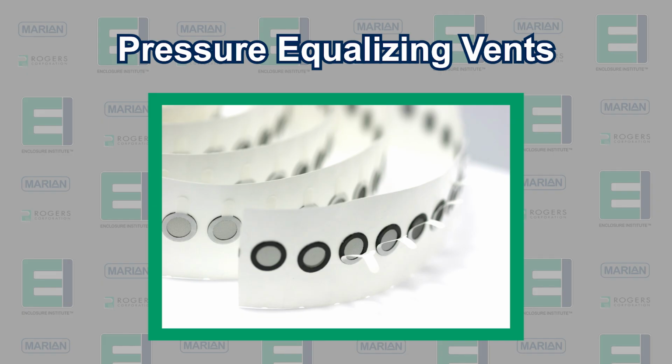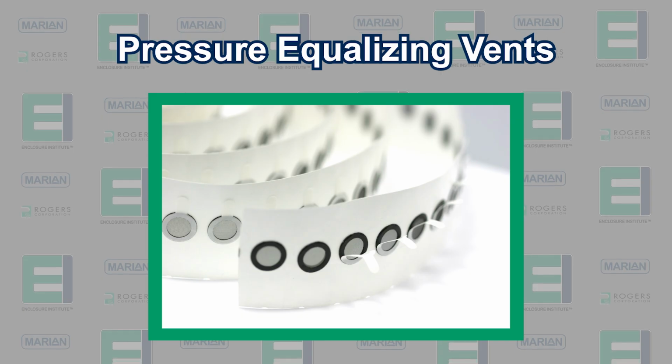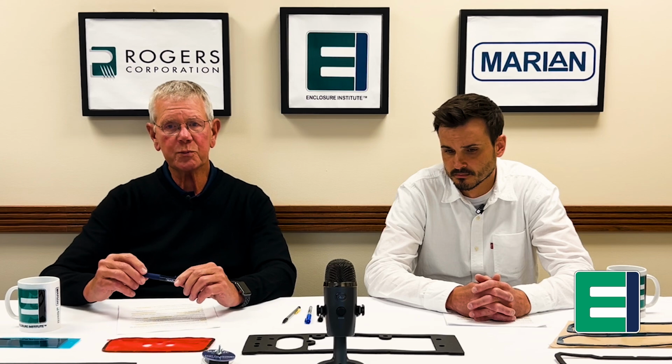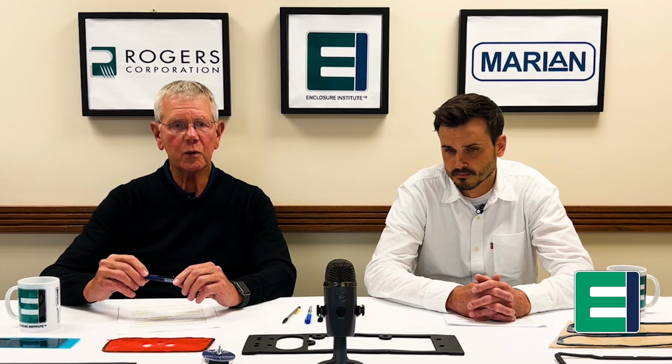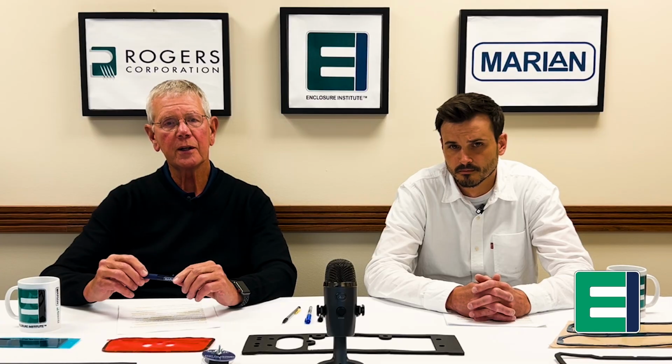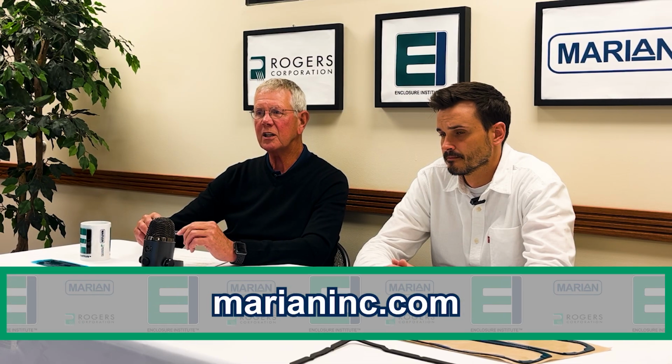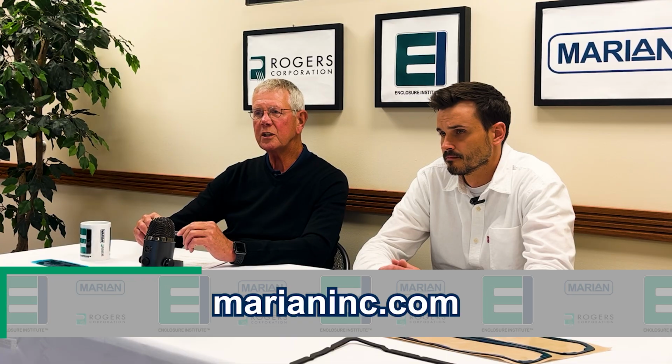You may need to include pressure equalizing vents in your enclosure to alleviate significant pressure changes. These vents help to equalize pressure by allowing air to pass, but with the proper venting materials, they won't permit the intrusion of water and moisture. As I mentioned, we'll discuss venting and venting materials in more detail in a later blog. In the meantime, if you have questions about vent construction and materials, give us a call or reach out online. We'll be happy to talk in more detail with you.